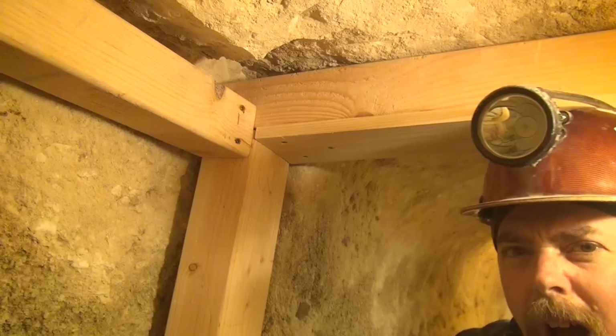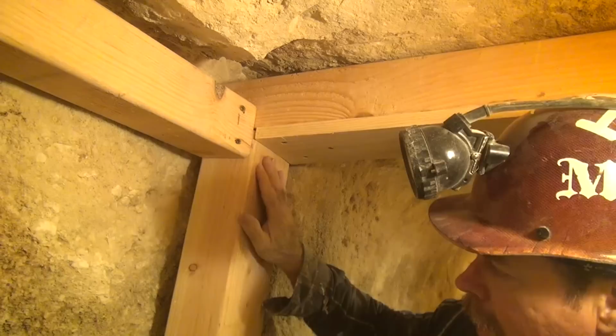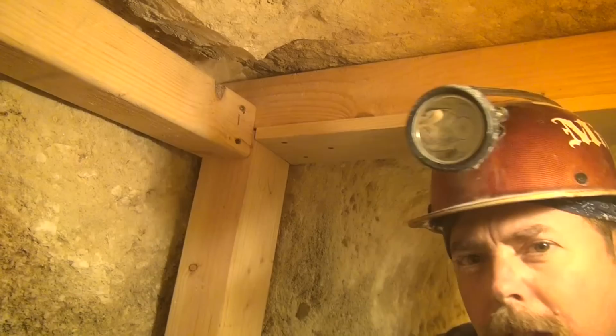All right, Christopher, Max, and Joanne, this one's for you. We got two sets put in. They're held in place with the collar brace. Now we got our posts set at about 5 degrees in. We got our caps on with our spreaders. The only thing that's missing now is the lagging.